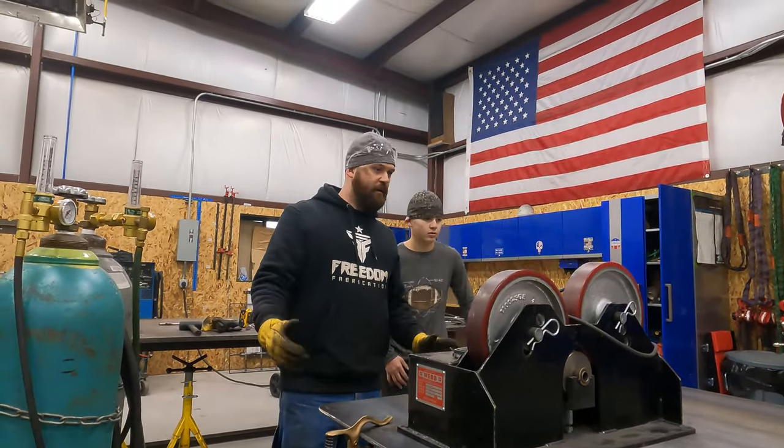I did get the flats all welded up, so hopefully you guys can see what I mean by the nice finished look it gives it when you trigger those verticals. And then, you know, if I have a start or a stop that sticks out a little further than I wanted it to, I feather it with a grinder. So there's just little things you can do to make your welds look better. That's going to wrap up the table itself.